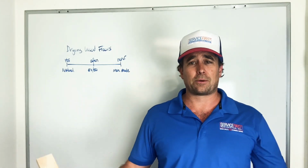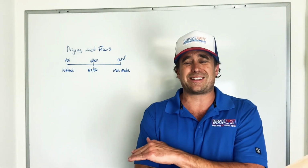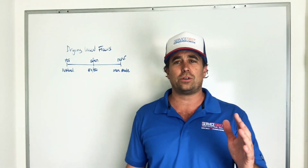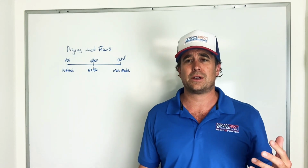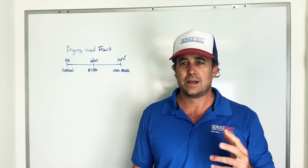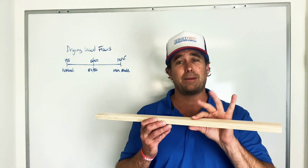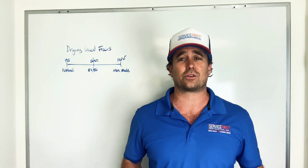So, to summarize it all, if it is man-made, it is very difficult, basically let's call it impossible to dry in place. If it is natural, God-made, sun, rain, all that fun stuff, you can dry that floor. And then if it is an engineered floor, which has aspects of it that are man-made and aspects of it that are natural, those oftentimes you can also dry in place.